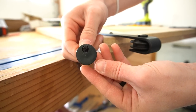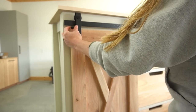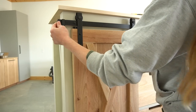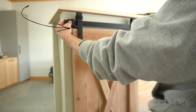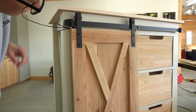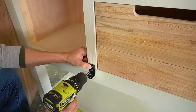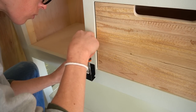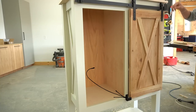The kit comes with these little spacer things to prevent the doors from falling off the rail. I installed them on the outside of the door, but I later realized they needed to be installed on the inside of the rollers. The way these work is you rotate them out of the way so you can hang the door, then rotate them back so that when you lift up, it can't come off the rail. These should be inside the rollers because when you add the stopper blocks on the rail, if they're on the outside, they'll bump into them. Don't worry, I did switch them. For the bottom, the kit also comes with a piece to prevent the door from swinging back and forth — one piece screws to the cabinet and the other piece screws onto it and adjusts front to back to accommodate the thickness of your door. I adjusted the stop blocks on the end of the rail to make sure that the door didn't go so far that it would pop out of the bottom piece.